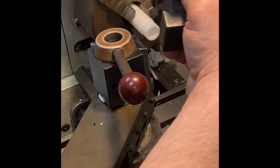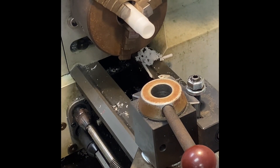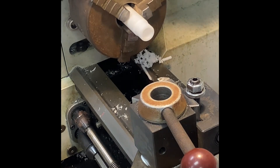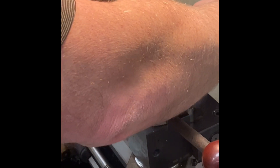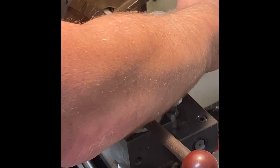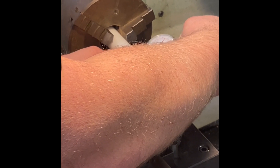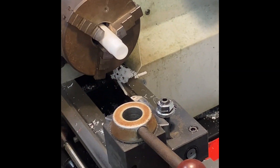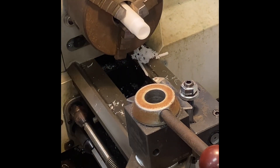The next step is to go in with my boring bar and bore out that ID to the size that I need. We did a 21/32nd drill, so we'd still use our calipers to take our measurement. Using the ID part of the caliper, the hole is measuring about 643 to 650 thousandths. I don't want to go too much larger than that, so I'm only going to take 25 thousandths — I want to be about 675 thousandths of an inch.